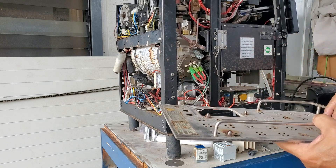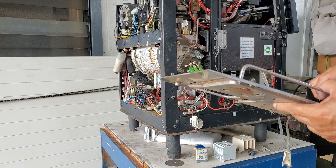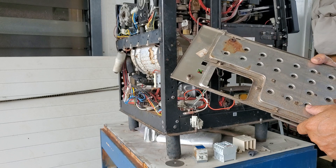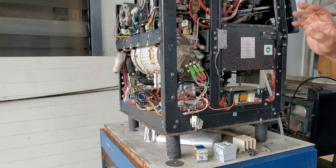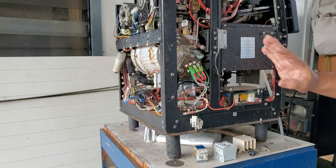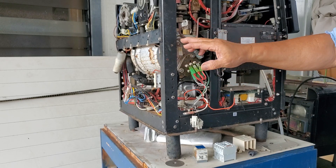Keep in mind that water sometimes ends up on top because people put wet cups there — it drains down and the heat evaporates it. That's why there's a protective plate; the water really doesn't drain into the machine unless you pour a lot in. So any questions, put them in the comments. Basically this covers the layout for heater and water filling for most modern espresso machines — they all work in a very similar way, monitoring water before turning on the heat. If you don't have any heat, check your water level.